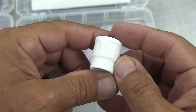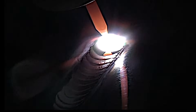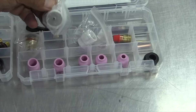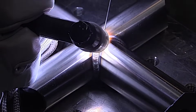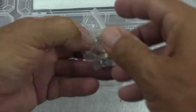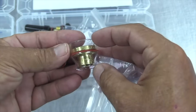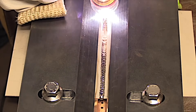The Jazzy Tin is a DC cup — great for stainless steel, chromoly, carbon steel, tool steel, even some light titanium work. Here's some 4130 chromoly on the second pass with a little pedal pumping. Another benefit of a cup like this: if you get a really well-shielded first pass, the second pass just goes in a whole lot better. If you need a little more shielding with a longer stick out, the ceramic 12 is a good choice. For stainless steel tubing, a little tip: get that puddle started quickly and get moving quickly to outrun the heat — sometimes hotter and faster is better. The clear BBW is a great cup for titanium.